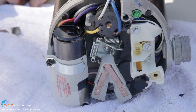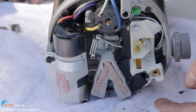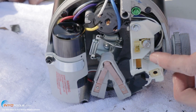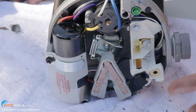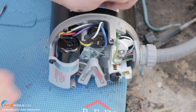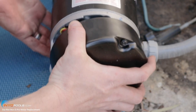There's a wiring diagram on top of the motor that you can follow. The motor is dual voltage but comes set on 230. There's a little knob that you can switch to turn it to 115. This installation is 230 volts, so we'll have two hot wires and a ground. The green ground line will go to the green screw, and the black and red hot wires will go to L1 and L2 — it doesn't matter which way, it won't run backwards. We've got the green going to ground and the two hot wires going to L1 and L2. We're ready to put the cap back on, tighten the two screws, and slide it into place.